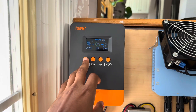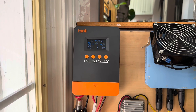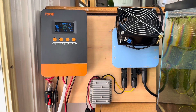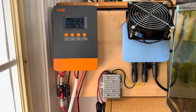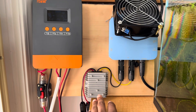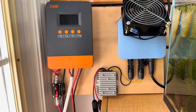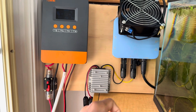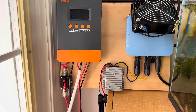As you can see right now, it's 200 watts coming in, about 9 amps — it's around 9:30 in the morning. The output right now is around 100 watts, mostly just the fan since the AC is on. It's fairly cold, around 60 to 65 degrees, so it's not pulling as much. But as soon as the compressor kicks in, you'll see that demand on the clamp on the electrical panel, and it's gonna send a signal to change the output of the inverter.